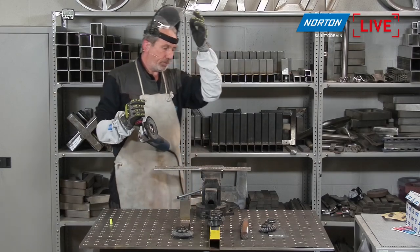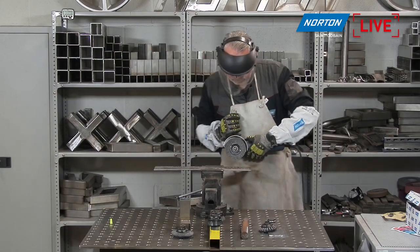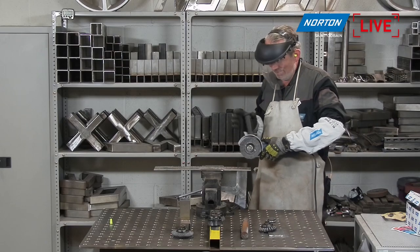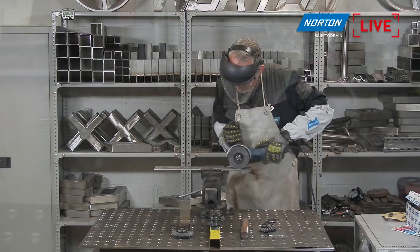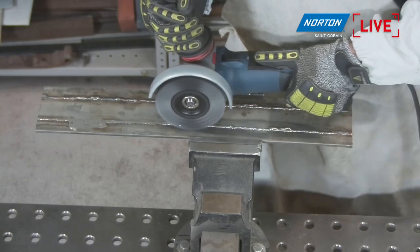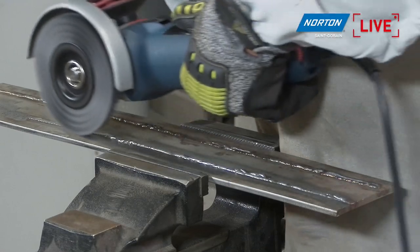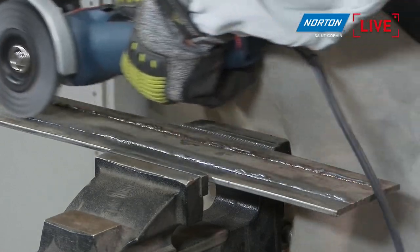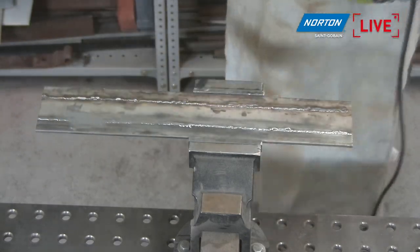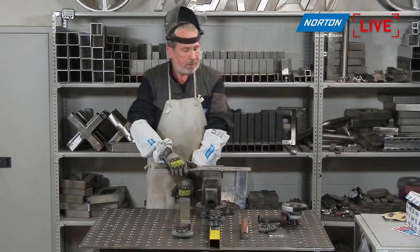Yeah. Paul, you press too much, you bend the wire, and the tips will not do the work. Then no pressure. Okay, right, I'm going to get some work done now. See how fast it works, no pressure, very low spark. Spark means we remove material, and if you see no spark, then we are removing just the coating, the part that is sticking on the material, not the base material.